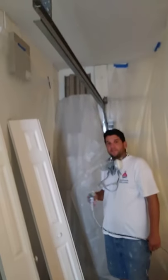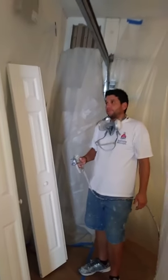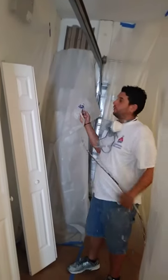It's a 308 from Graco. It's their new line of tips. They're fantastic. You use less pressure, and the paint comes out looking like glass. So watch this work.